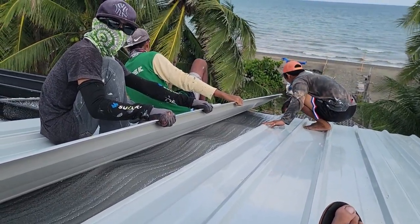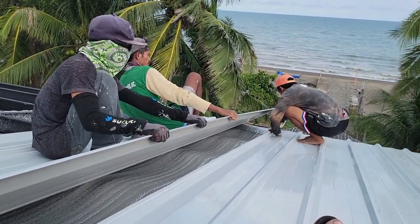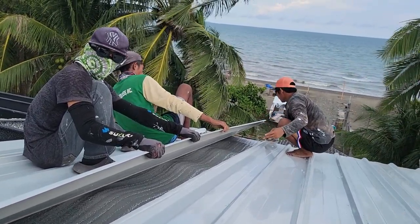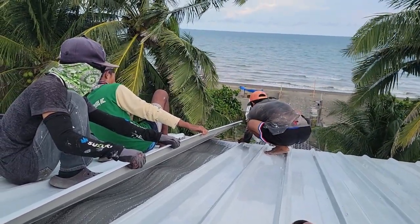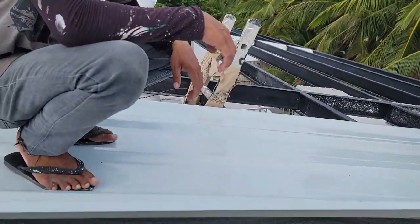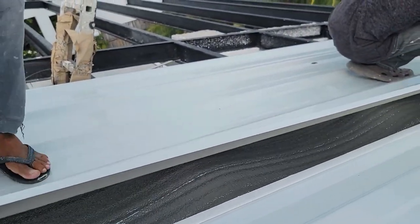And keep it back about an inch from the end. Stay back about an inch and a half, because it'll melt and you don't want it all dripping out the end. Just tear it. No need to cut. Just tear. Now, smash that down really good and then peel that paper right there.